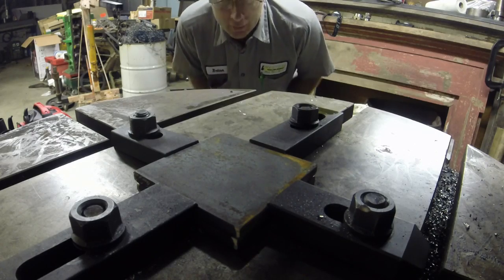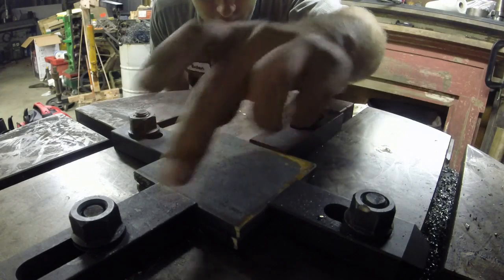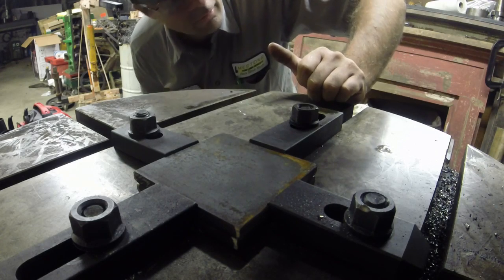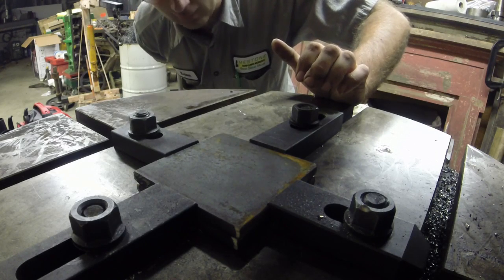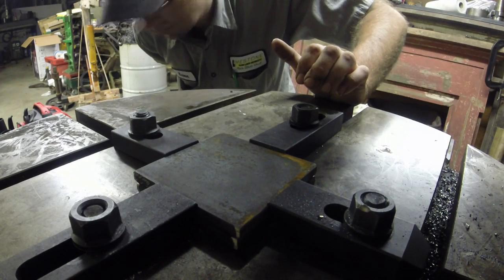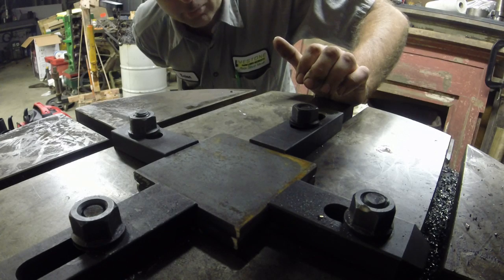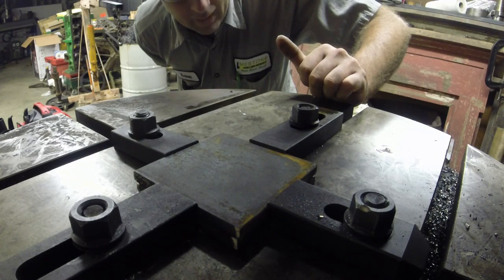Battery died last time — third time's the charm. Got this fixture down here with my toe clamps catching them on the ledges. Works good, keeps it low profile. I've decided I want to run my cutter at 42 degrees — seems to be a good match. So I'm guessing that must be an inch and a half radius, not three inch. I don't know if the lens is a 5x instead of a 10x or if I read it right. But anyway, the math should be correct, assuming you actually know what radius you're working with. Let's get this mill fired up and cut this thing.